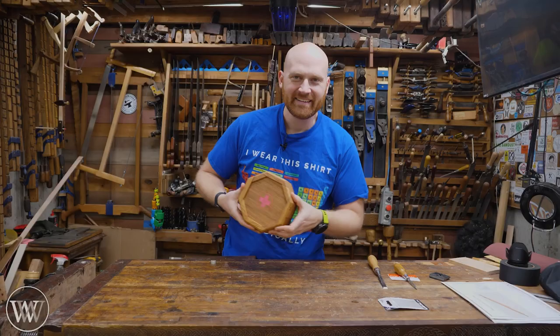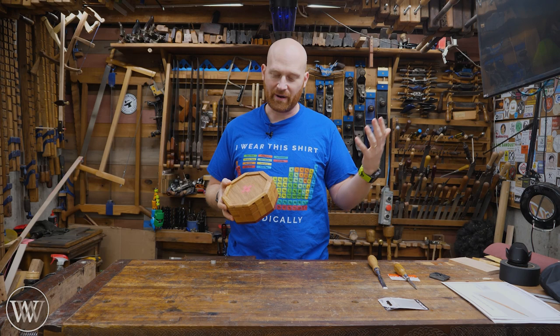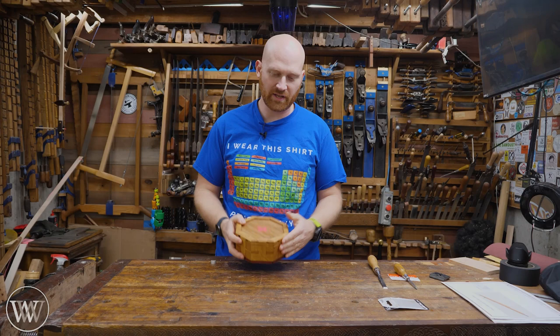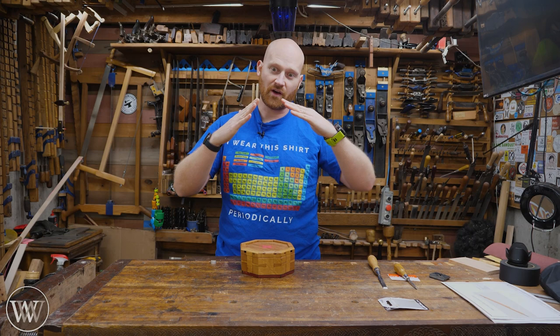Now there you go. This was a lot of fun for me to put together. Now, if you haven't noticed by now from the Wood by Wright channel, I like to learn by jumping in at the deep end. The smart way, the common way to do it would be to actually make this out of a cheap wood first and get used to making all of the dovetails. I've done angled dovetails before, but usually they're only splayed by a few degrees, and those are relatively similar in comparison to regular dovetails. These took a little bit more getting used to because the greater that angle is, the harder it is to get that exact measurement.